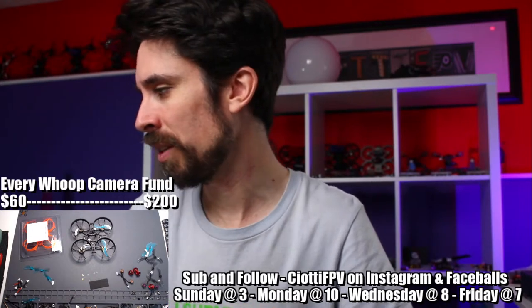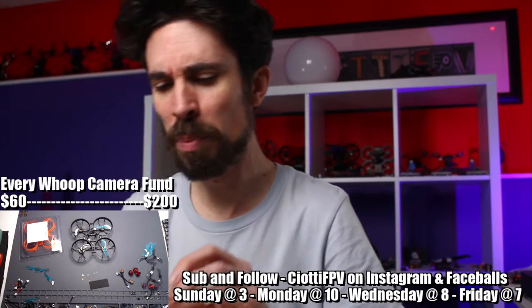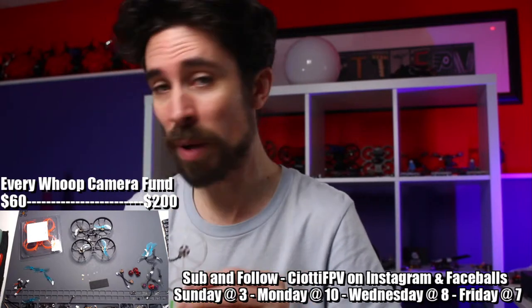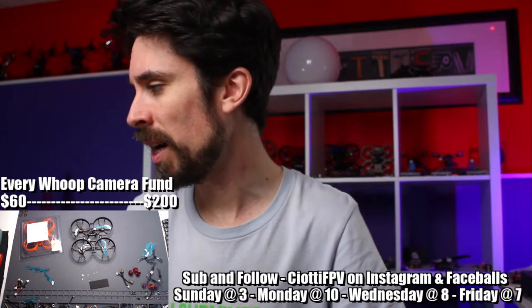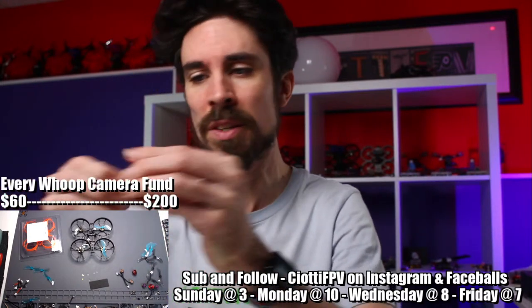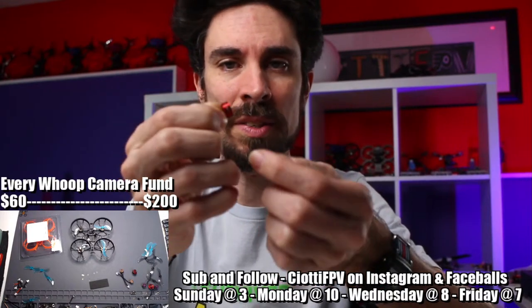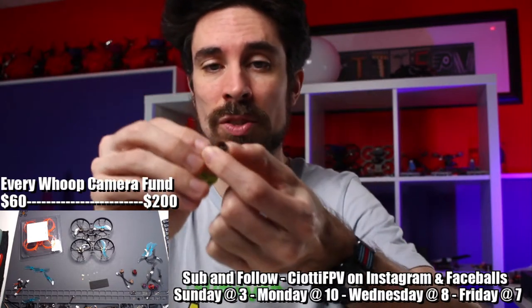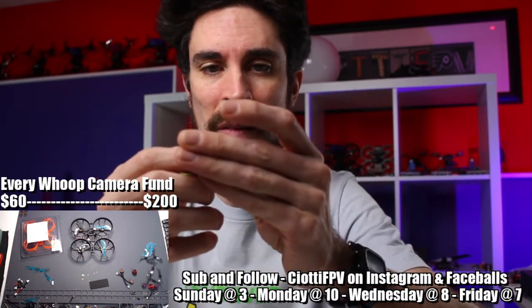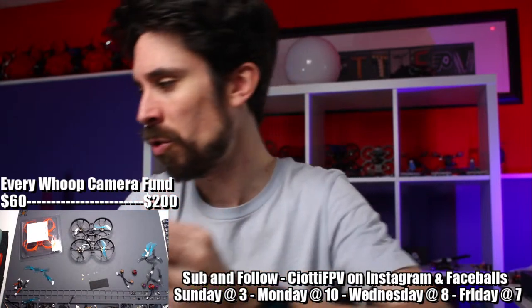I think the bushings on the, no, that's not true. The bushings on the red stators are fine. The red 30,000 KV stators are fine. It was these motor shafts on these 0802 30,000 KV ones. For some reason, the bottom of the motor shaft is just a little bit too big. Very, very weird. I've never had that happen before. That was super confusing.